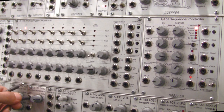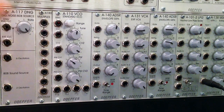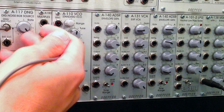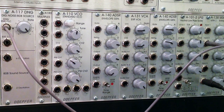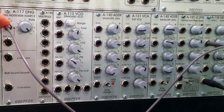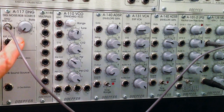For the A117 digital noise source CV applications, let's look at the dial again. It took me a little playing around after reading the manual to understand that the slowest rate is at the high number end and the fastest rate is at the low number end. Once you plug it in and listen it becomes fairly straightforward - at the 10 mark you have the slowest rate with audible clicks, and at the highest rate it becomes a noise source.